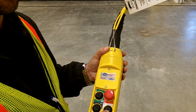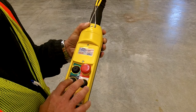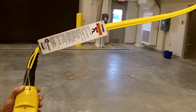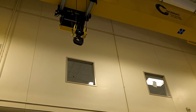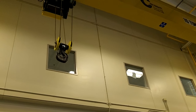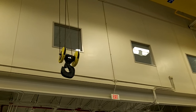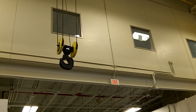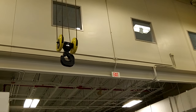We've talked about the startup procedure and the checklist. Now it's time to run the crane. This crane is equipped with two-speed up and down motion. Simply press down on the button to the first detent — that's your slow speed. If you press a little farther through the resistance, you'll be at high speed. We recommend that as you start to rig and pick up a load, you use that slow speed to start your pick. Same in reverse — when setting down a load, use that slow speed for your final adjustments.